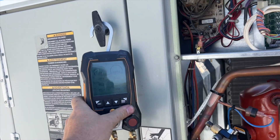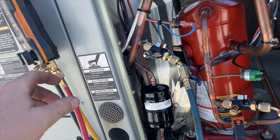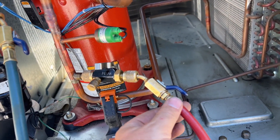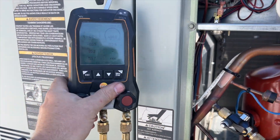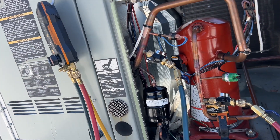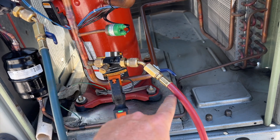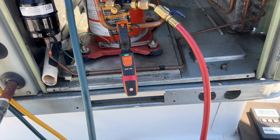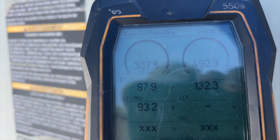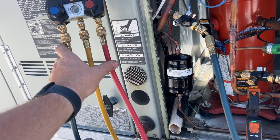You need to be wary about your hoses. I've replaced the gaskets and I still have a leak — when I had it under pressure I noticed I was dropping pressure. The only thing pressurized is my hose and it's leaking. Be wary when doing pressure tests with hoses — make sure they're not leaking. I've replaced both gaskets so I know it's not the gasket. I shot it with leak detector but got no bubbles. Testing my blue hose and it appears to be holding, so it looks like it's just the red hose that's bad.